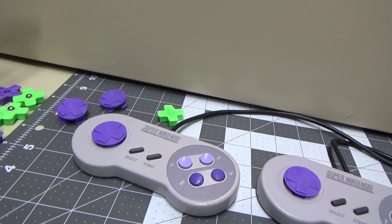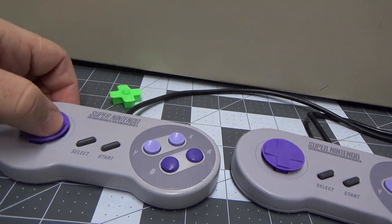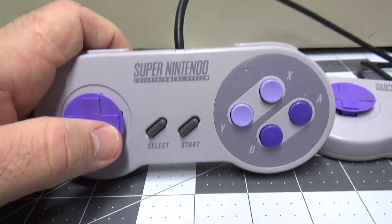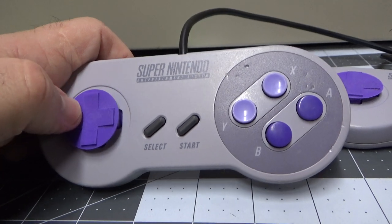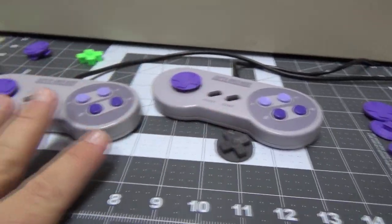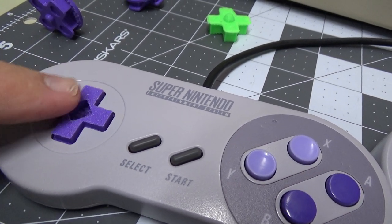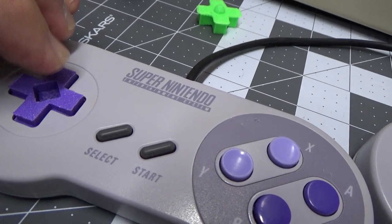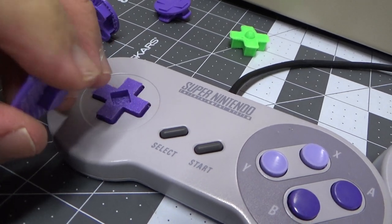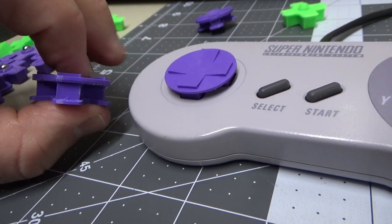This design seems to be probably the best — it's almost like an upside-down Super Nintendo controller because you've got the disk on top. What that does is when you're playing, you can actually press a diagonal; you don't have a gap in the directional pad. We still have the directional pad shape, so it's a little bit more like a Saturn pad, although the internal design is different. We're still using membranes for the contacts. Here are two of the final versions — they're slightly different. This one has a slight taper on the cross pad, which cuts out some interference.